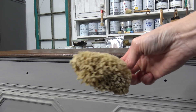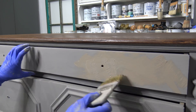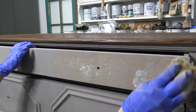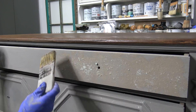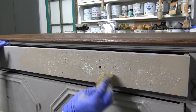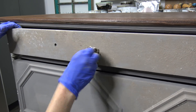I'm going to use a natural sea sponge as well as chippy brushes for the two paint colors, French Linen and Cocoa. All I'm going to do is slap on a little bit of both of them, and with my moist sea sponge I grab a little bit of salt wash, dab it into the container, and apply it on top of the paint as I go. I just keep layering — adding paint, adding salt wash, adding more paint — so I can put the textures where I want and create a really old, nostalgic look.